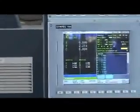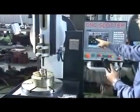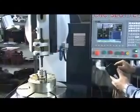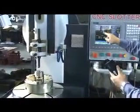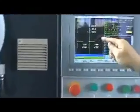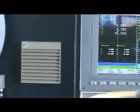So first we must go to the zero. Then the first step, indexing. So always the same, it's 45, you must stop. Yes, 45. Then you go to the first starting point, 7.2, right, but minus clearance 0.5. So you must stop at 6.7, then the RAM runs. Why is the value 6.7? Because of 7.2 minus 0.5 clearance. Okay, right?